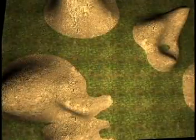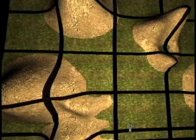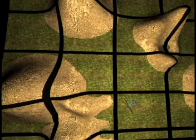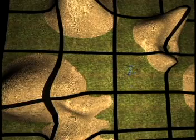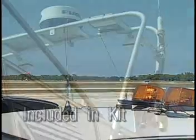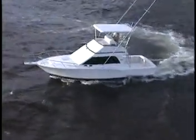In an actual emergency, the search area to be covered may likely be larger than what you've practiced. You may not receive a signal when you arrive at the search coordinates. To be most effective, divide the area into a grid and begin a coordinated sweep. Methodically move through it, periodically stopping and taking two circular scans with the VECTA-2. With the VECTA-2's omnidirectional whip antenna, the unit can be kept on at all times in your boat or vehicle, constantly monitoring for a beacon signal. Then, if a beacon is activated nearby, you're immediately alerted and the search can begin quickly.